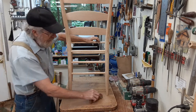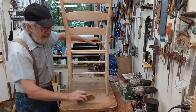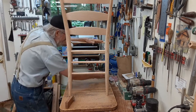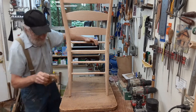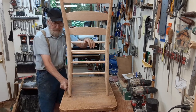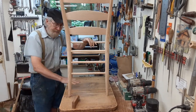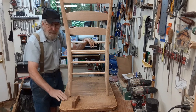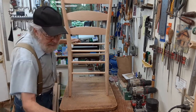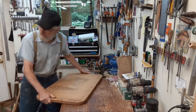I'm going to take that now and make a mark around these back legs. I'm holding this flat on the surface and going around, holding the chair down — it's contacting here, here, and here, not here. But this mark is the same distance up from the surface. So there's more going to get cut off one leg than the other. Theoretically, all these levels are in line with each other. I've set that aside along with the nuts. Nuts of different sizes make good little spacers for things like that.